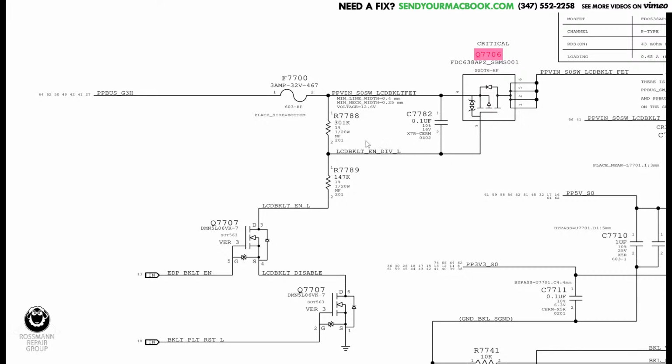Remember, what a voltage divider is going to do is you have the high voltage at the top, then in the middle, you're going to have the divided voltage, a lower voltage, because some of this stuff is going to get sent to ground. So this resistor says, okay, some of the 8 volts gets to go here, and then this resistor says some of that 8 volts gets to go to ground, which is kind of like your recycle bin or your trash can for power. So what you're going to be left with in the middle is like 4 volts. Not 0, not 8, but like 4.